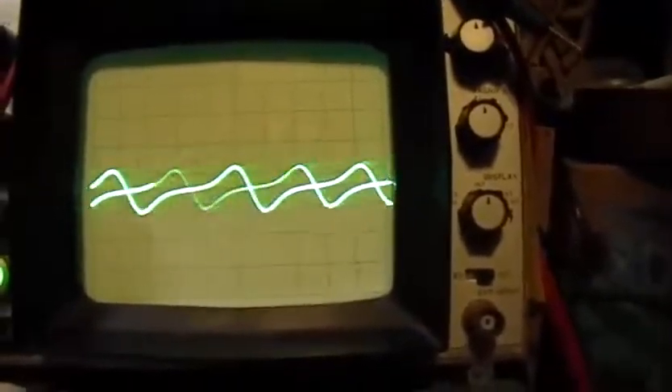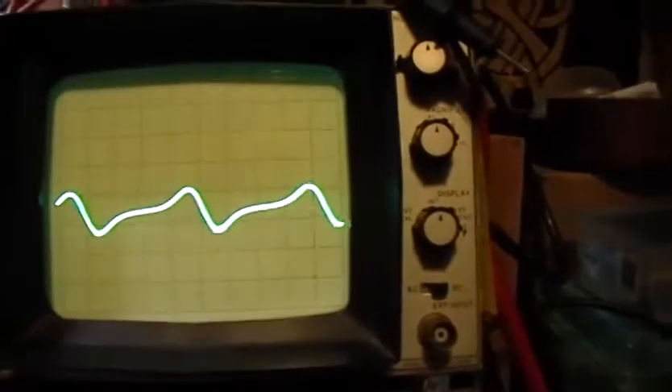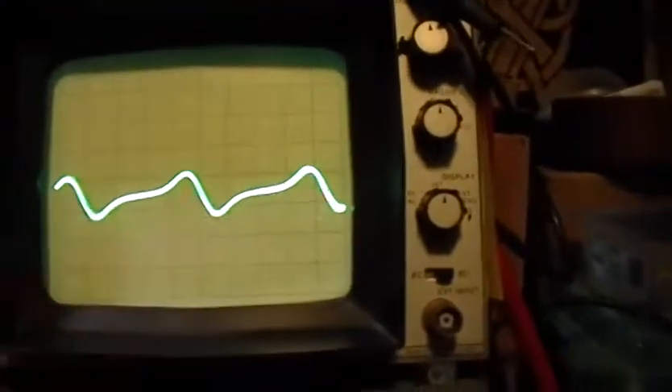If you look at the trace, you can see how it looks like it's going up from left to right. That's because the CRT is actually mounted a little bit crooked in this frame. But the lines are parallel to the graticule. That's a pretty good sinusoid when the magnet passes the coil. This little gap here is because the magnets are really too far apart for a generator.